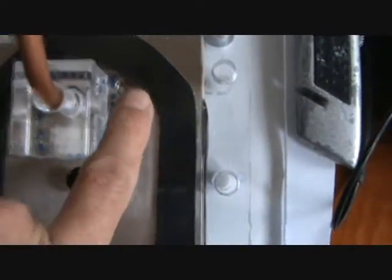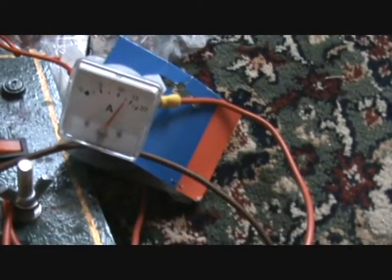They're basically the same but not quite the same. The bottom ones all line up - they're big holes for the water to pass through and they all line up. This is a small flat unit. I've basically got one pipe to the other and I've stuck some salt in it - probably too much because it's drawing like 15 amps. It's at 1039 seconds to get 250 millilitres, drawing 11 volts and about 13 amps. But it pumps out just fine.